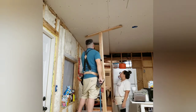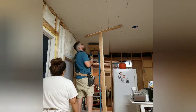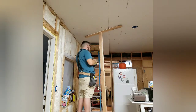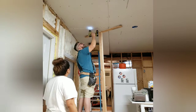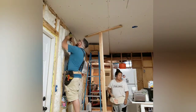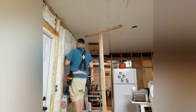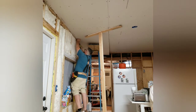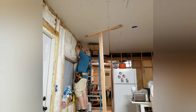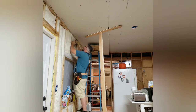To the right you can see where we're going to put our pendant light for the island. I do suggest going ahead and making your cuts for any pot lights, pendant lights, or fans you're going to put in the ceiling once the drywall is up — do your cuts then. You don't want to do it after when you're mudding, because I think it just slows down the process. If it's already cut, you really just have to go around and start painting.